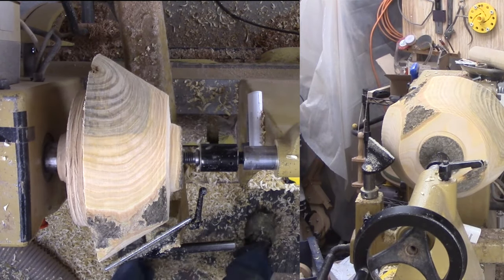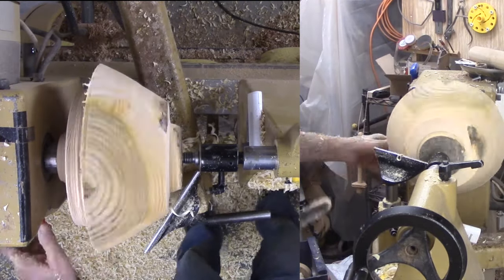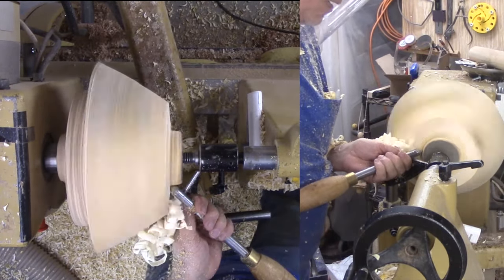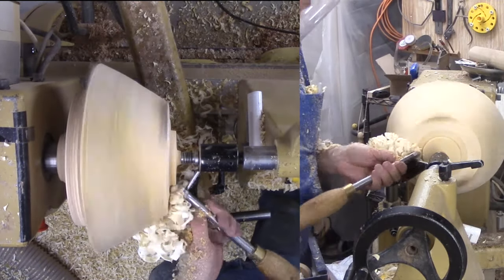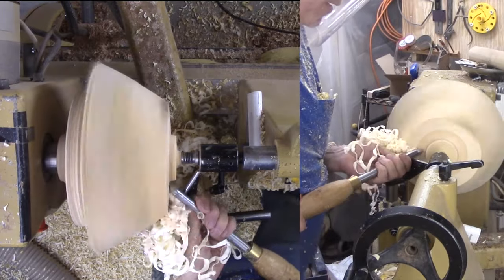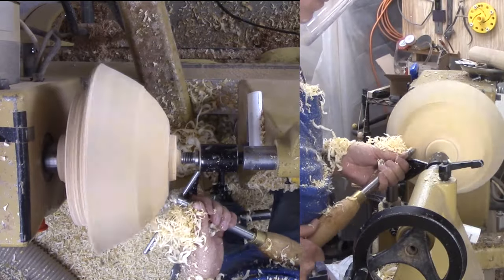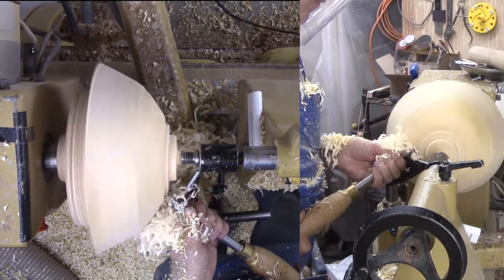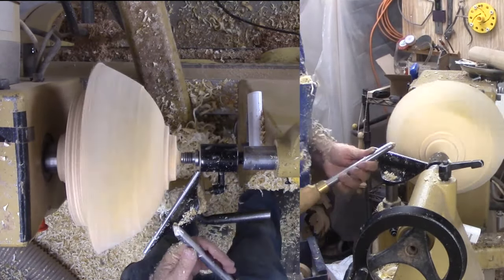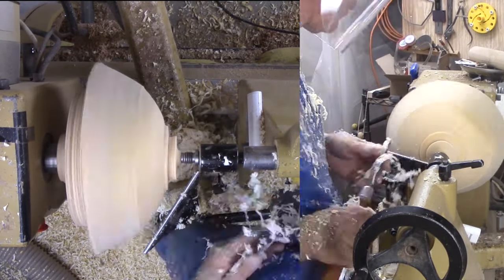Slow goes the cut at first as the wood is very off balance. Still, I have to start somewhere — how about the bottom corners? As the bowl gouge cuts it round, I can increase the speed and be more aggressive with the cuts. Then cut back the bottom to see where I can cut a tenon. Looks good, so I continue to round off and shape the bowl. I am committed now. There is a crack to remove at the top corner — I have to cut back the height to get away from the pit.